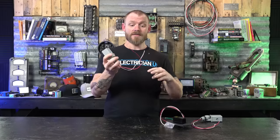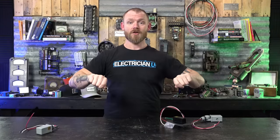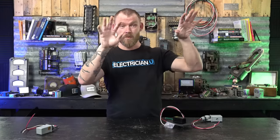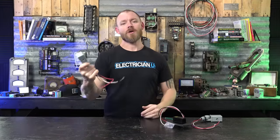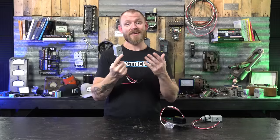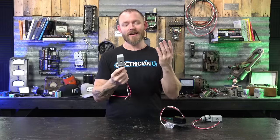You can take the wire nuts off because you'll have the outgoing leg going to the lights and the incoming power. You could just take the photo cell completely out of the equation — touch your incoming power to your switch leg, put a wire nut on them, and see if all the lights come on. That tells you it's not a problem with a breaker, relay, contactor, wiring, or the lights themselves. If I'm troubleshooting, it's usually the photo cell that's the problem, but just to verify, I'll direct wire everything, watch all the lights come on, and confirm it's a bad photo cell.